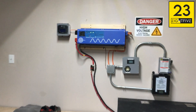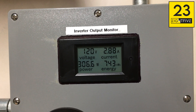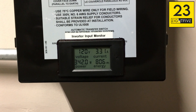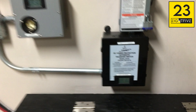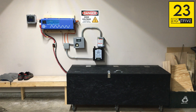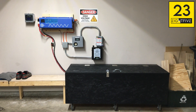If we look at the inverter as it is right now, you can see that it's in AC mode and we're in float charge. You can see the output voltage from the inverter to anything in the house — we have 120 volts out, about 2.8 to 2.9 amps, and about 305 watts. On the input side, coming from the utility to the inverter, we have 120 volts, 350 watts, and about 3.3 to 3.4 amps. That's because the inverter's in float right now to keep the batteries fully charged. What I'll do now is cut away, get the generators hooked up, and then show you what a transfer looks like.